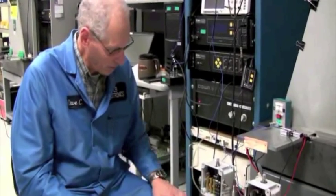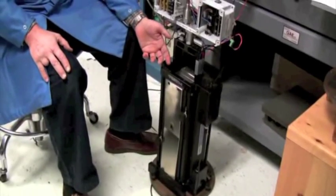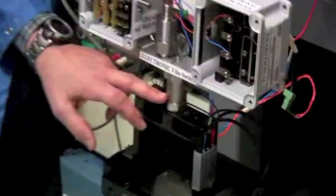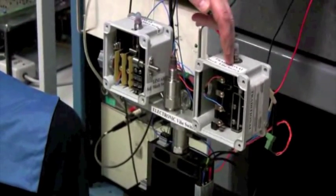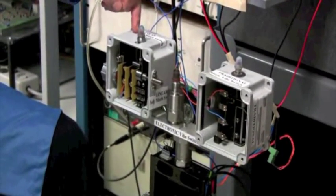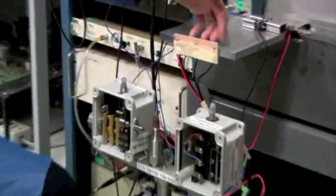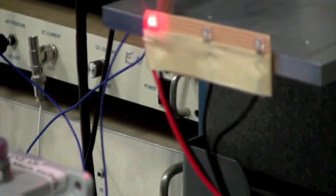The basic equipment we're using for this demonstration is the long stroke shaker that will allow us to do low frequency, high amplitude inputs, a back-to-back calibration standard so we can verify our inputs, the three switches, traditional mechanical vibration switch, the electronic vibration switch, and the new linear adjusting mechanical vibration switch, and three LEDs so you can see when they trip. When any given switch trips, an LED light will come on indicating that it has occurred.